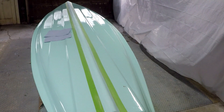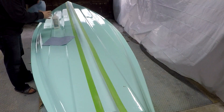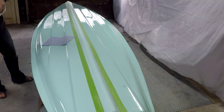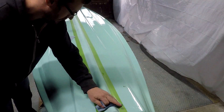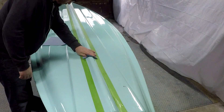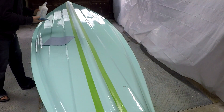After you get that first etching done, go ahead and clean it with some rubbing alcohol. Make sure you have at least a couple of shop towels — do not use rags. Rags will leave fibers in there and will reduce the adhesion of the keel guard. I would recommend flipping your shop towel over a couple of different times and going over that area at least twice on the full keel.